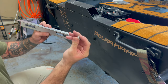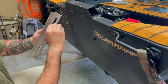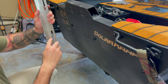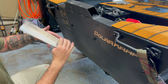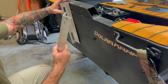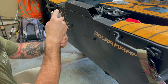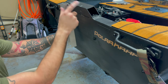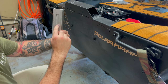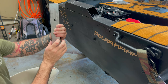That way, see, I got these carriage bolts, got to where they'll slide in there. That way you can adjust it. Now, I did it on both ends. So what we're gonna do is we're gonna mount this plate on here, and then I took my other piece, and actually I just put it up here. I basically evened them up because that would be flush with what I already have. So I don't wanna go any lower than that. And I went ahead and made 2 marks, and then drilled those holes out 5/16.